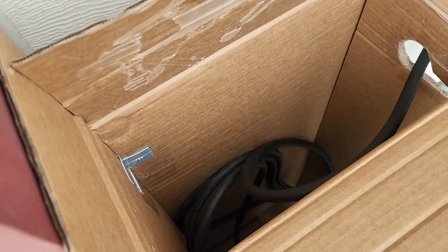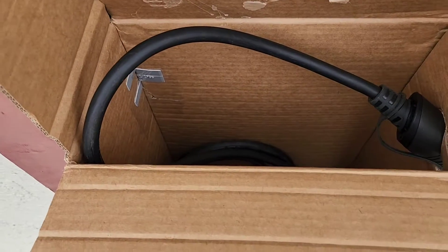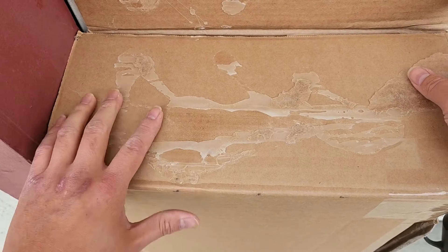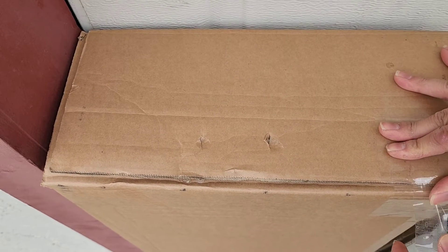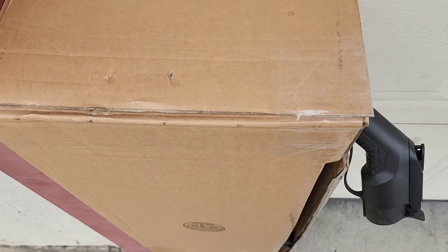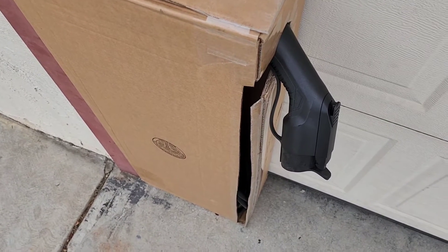Once you get to the end of the cable, you just push this piece into there and it holds itself in place. That's pretty much it - that's my makeshift car charger. I actually have a special adapter that lets me combine two 120-volt outlets so I didn't have to install an actual one, but it has to be on two different breaker switches. That's how I can get 240 volts at 15 amps. It doesn't charge as fast because it's only 15 amps, but for a Tesla it was saying about 13-14 miles per hour of charge rate, which is more than enough for me.